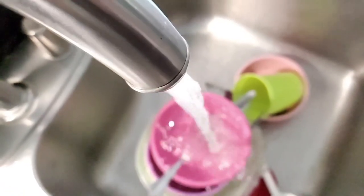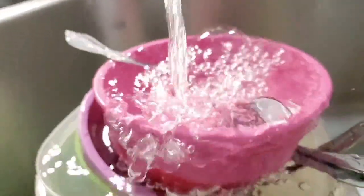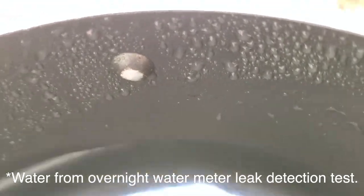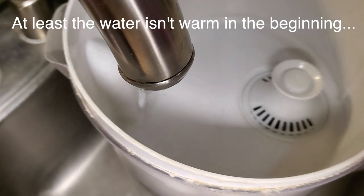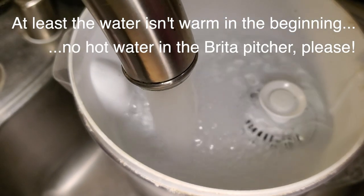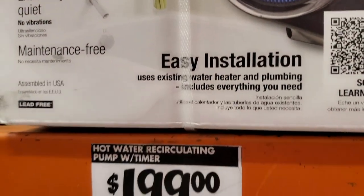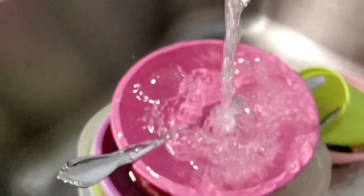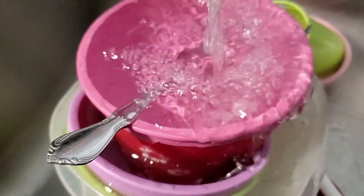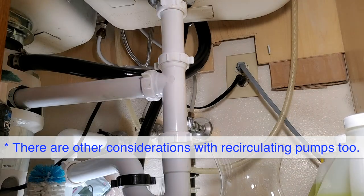You could run the hot water to pre-charge the line and somehow use the cold water coming out of the hot line to rinse off the next round of dishes already piling up, or capture it to water plants. However, you have to ask yourself, do you do this every time? There's also the option of adding a recirculating loop to your plumbing. That will be an extra cost. The answer might be perhaps, but I'm going to venture most normal people do not want to run extra water to pre-charge a hot water line, nor do they want to add something else under their kitchen sink either.